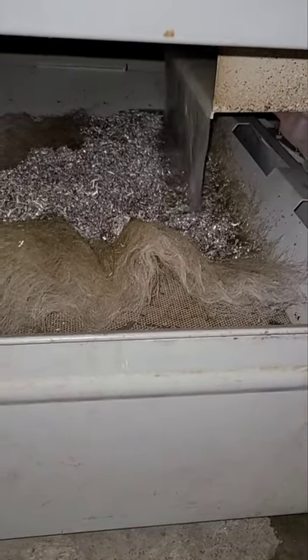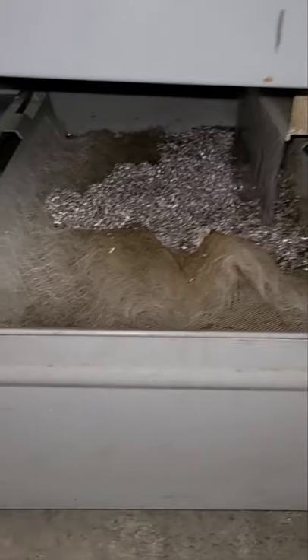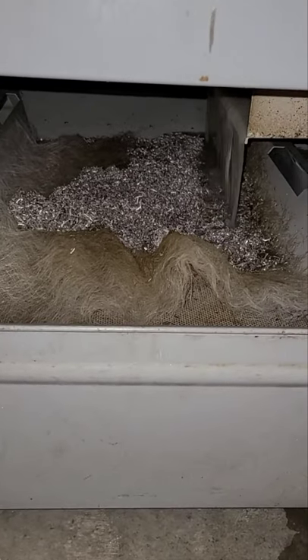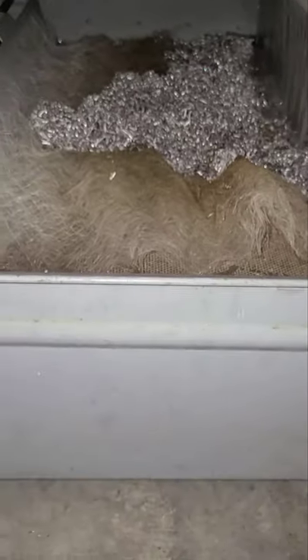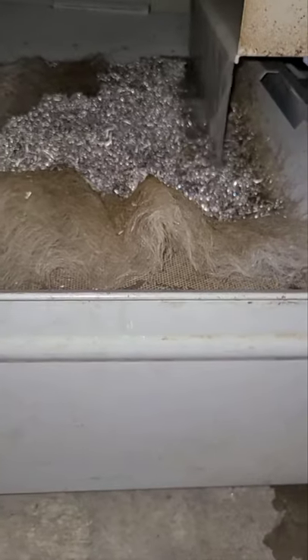The first thing before anything, when you're running the machine or cutting anything, you should have something that catches chips. This is how I made my own chip catcher to catch all the chips so they won't get into the tank. It's a pretty good idea — I haven't had any chips in my water. I got this from an air filter, just cut it up and use it as a mesh.